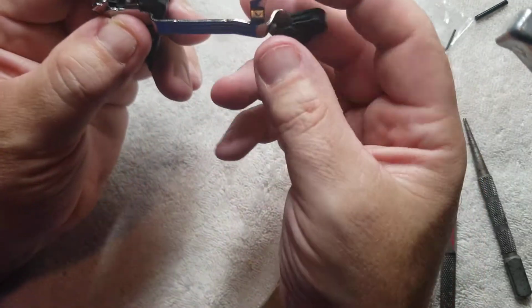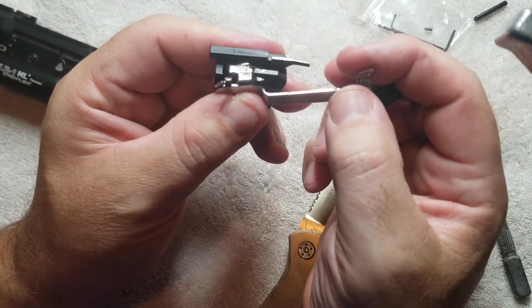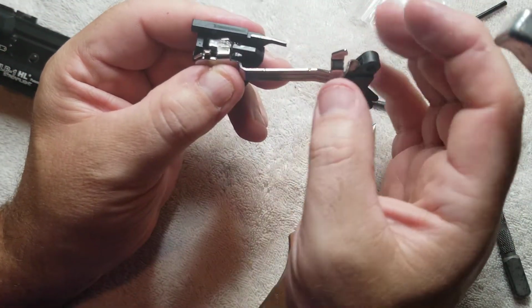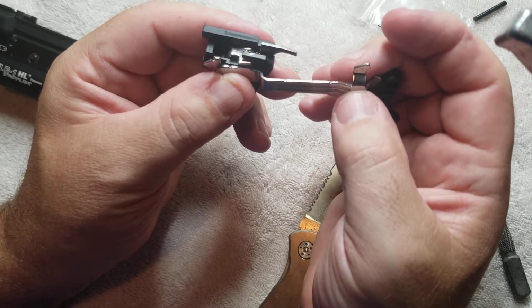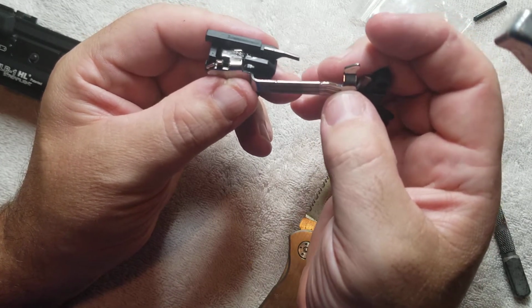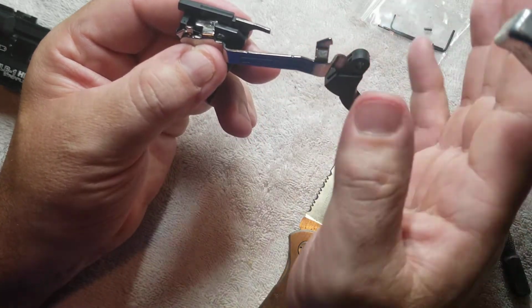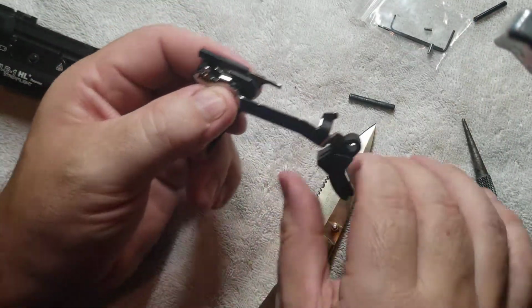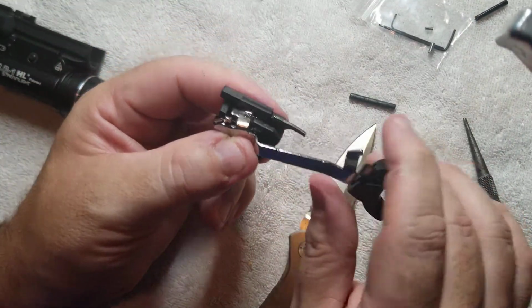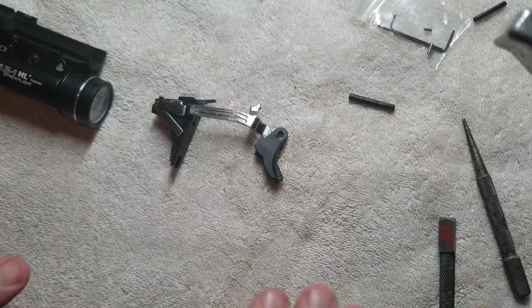And then here, from this slide back and forth, front to back travel, the other set screw goes back there, and it is adjustment so we can control exact position of the travel when things let go and things like that. So it gives us a full ability to fine tune the whole trigger. Okay. And again, the weight has not been reduced.